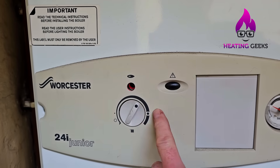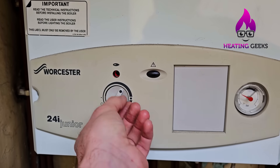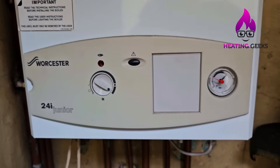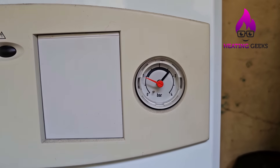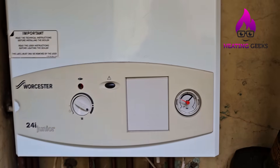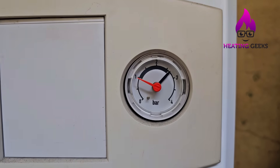This temperature is turned down low to save the boiler — I saw this a week ago and turned it down. If we turn that up and give it another few minutes, the pressure's going to get higher and higher. As the temperature of the water gets hotter, that pressure will just keep rising.